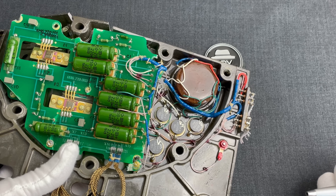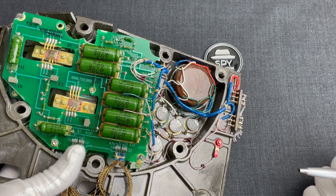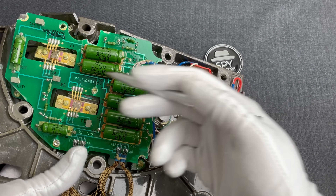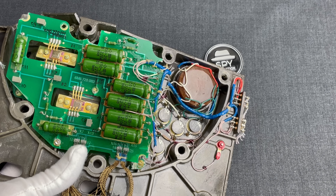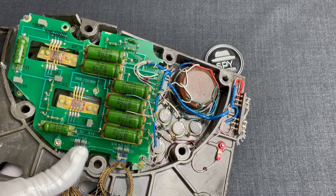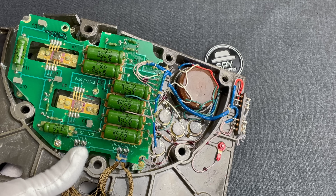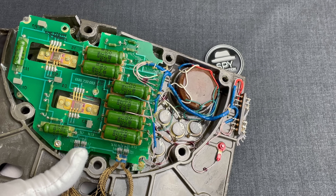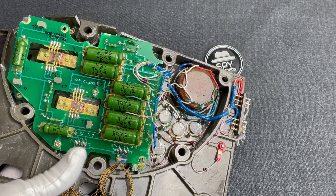This means the diodes are operating as a so-called bridge rectifier, converting AC to DC, which is then fed to the board. You might wonder why would the missile system have AC power — is it externally powered or something? Actually, it's quite common for DC thermal batteries in missile systems to be converted to AC in order to have multiple stable voltage rails and be able to directly power components that operate better with AC, like aerospace AC fin control motors, or even older inertial gyro systems that were relying on phase-sensitive detection for higher accuracy.